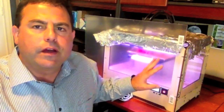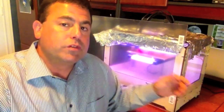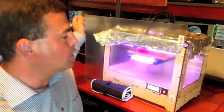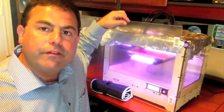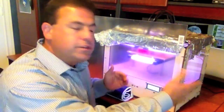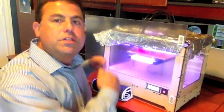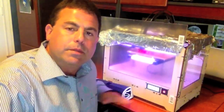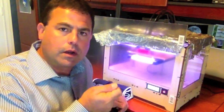What I found is you really have to start blocking off these sides. I started off by just using whatever I had on hand, then moved to foam core, then aluminum foil, and now I've moved to acrylic sheets — I'll show that to you closer up in a second. I've already built the left and right sides. The front I have here I've yet to cut out because I'm still working on how to attach it. The sides you don't really have to take off very often, but the front you access all the time — that's how you get the prints out, replace the Kapton tape, wipe it down with acetone, and do your leveling.